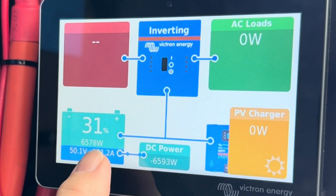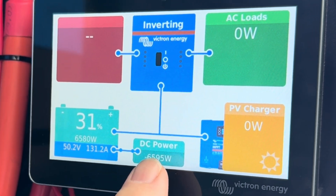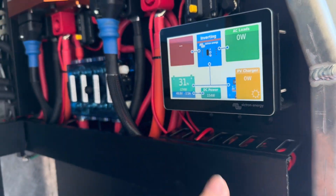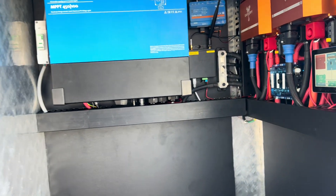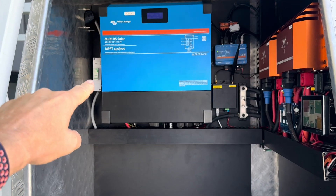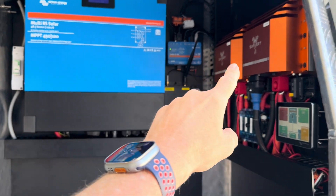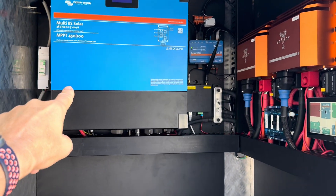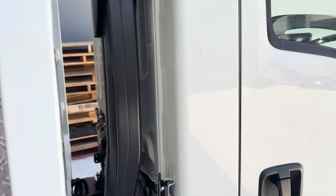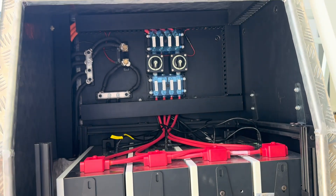You can see it here on this side as well — twin alternators, over 3200 watts each. We've got the inverter charger there, mainly for charging, that's 4000 watts of charging. So we actually get more power out of the twin Scottys than we get out of the Victron 6000 inverter charger.